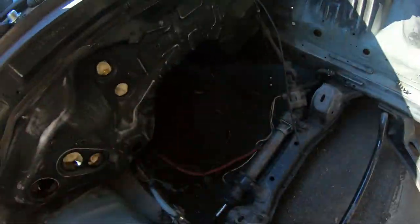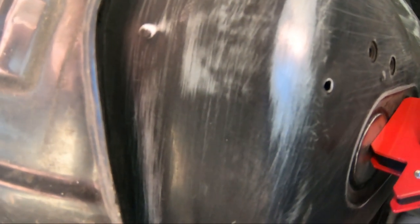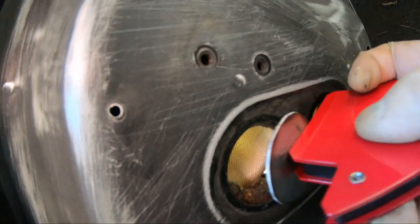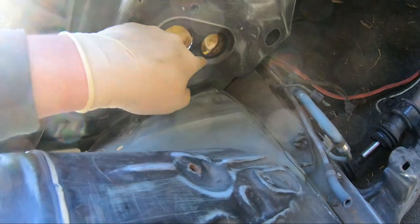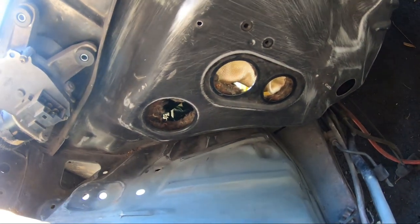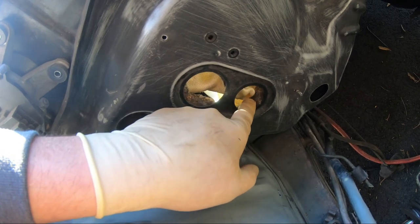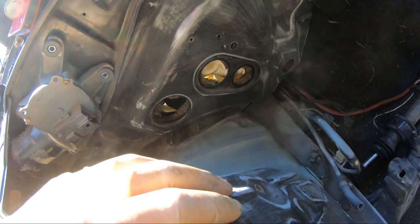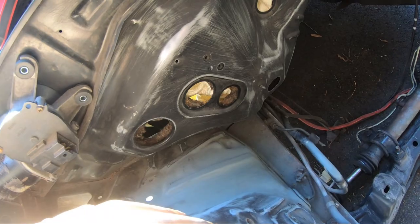I measured them up last weekend and I ground this circular one down, so I got it fitting pretty damn good. It's pretty much flush. I'm gonna get my die grinder and grind the area around it to get it cleaner and get the paint off. Then I'll move on to the next plug, grind that one down, get it perfect, and then we'll get to welding.